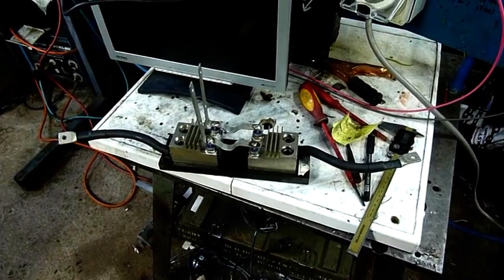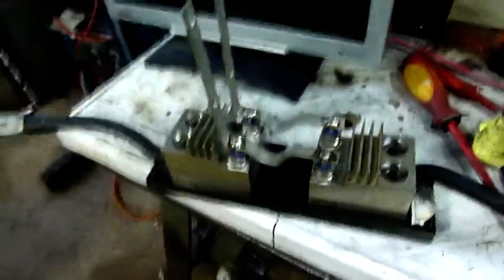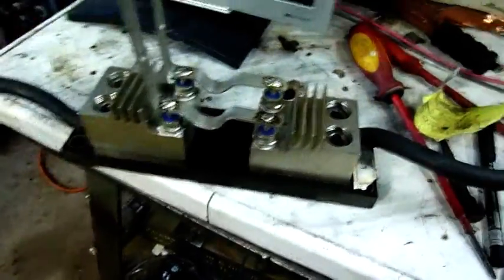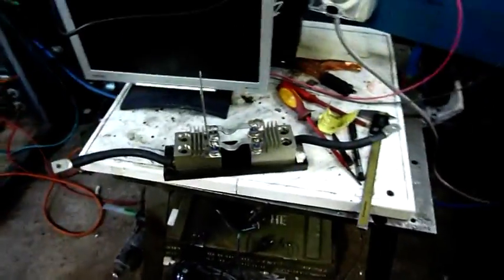It's the next day and I did a bit of finishing off last night — I soldered those bridge plates in there. This is going to be alternating current going in, and I can tap off these terminal blocks for direct current going out. Because each diode is rated at 60 amps, it's only 60 amps — you don't combine them. The diode cases vary in their polarity so they can be mounted in this configuration without blowing anything up.